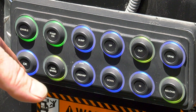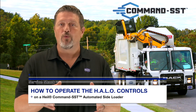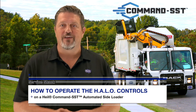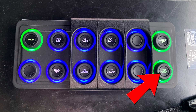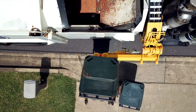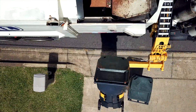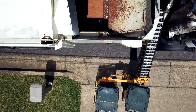Remember to disable the Outside Control Panel before returning to your regular in-cab controls. Before we cover what you'll need to do to complete a stop, let me tell you about another key feature that comes standard on the HALO controls. On your control panel, there is a push button labeled Pick Place. This feature allows the system sensors to detect where the cart was picked from and place it back where it was found. This Pick Place feature can only be used with the Autonomous Lift function enabled and is only available with the HALO control package.